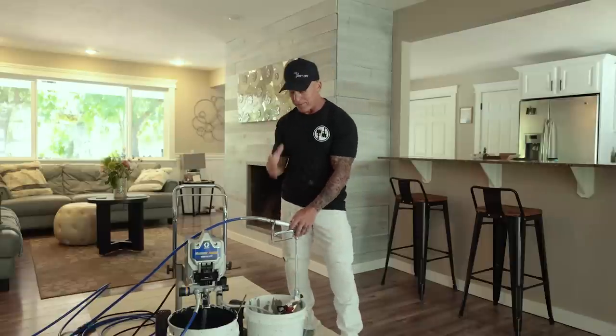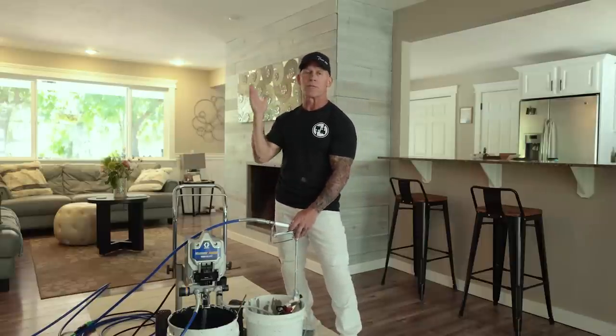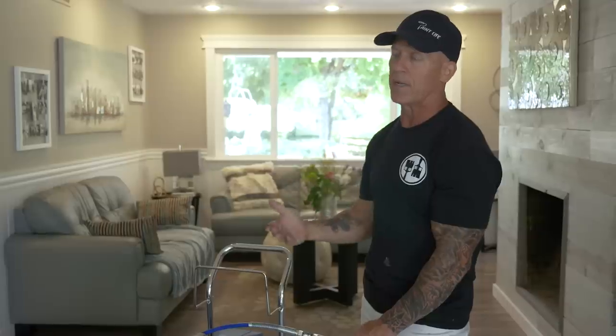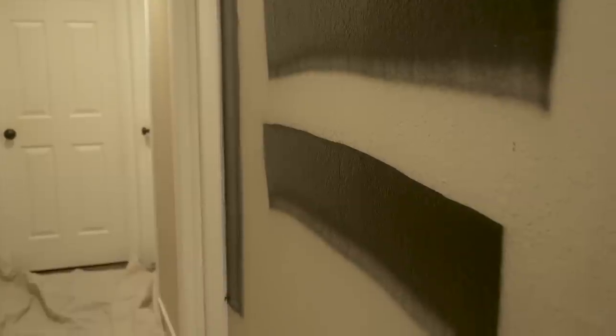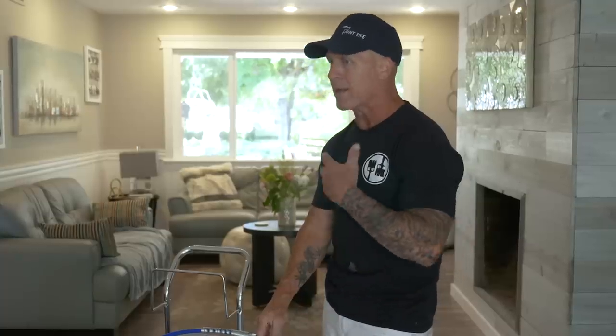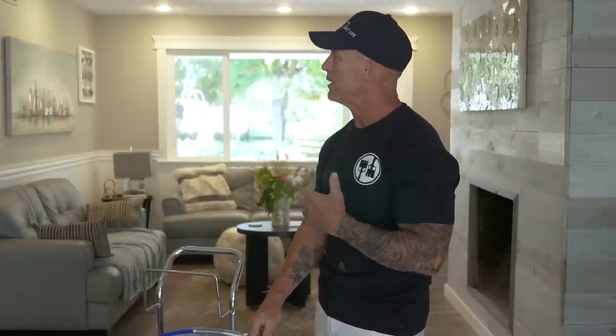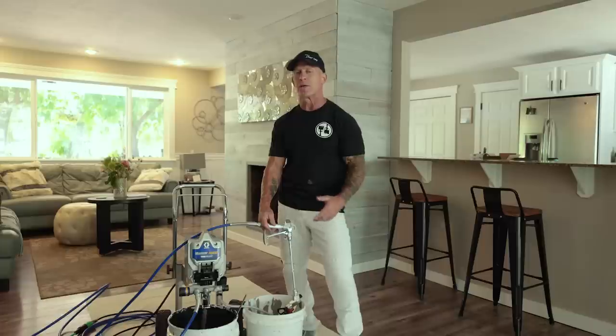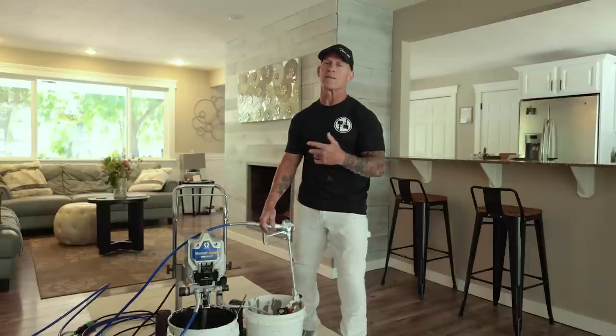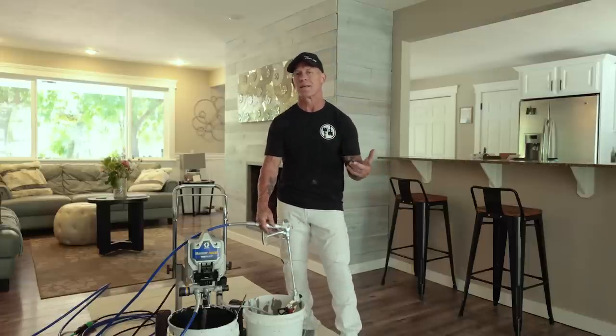The device itself, the roller, it's really difficult to keep going in a straight line, keeping it going at a steady pace. It has a tendency to wander in and out of your 90 degree corner. It bounces up and down on any uneven surfaces, allowing overspray to go underneath it. So it's just simply frustrating, and having the rag and wiping it continually, you have to keep the rag with you because you have to wipe it, with the paint I'm using, about every 5 to 6 feet, which is very annoying also. And to me, once again, painting with a brush is a lot less frustrating and takes a lot less setup.